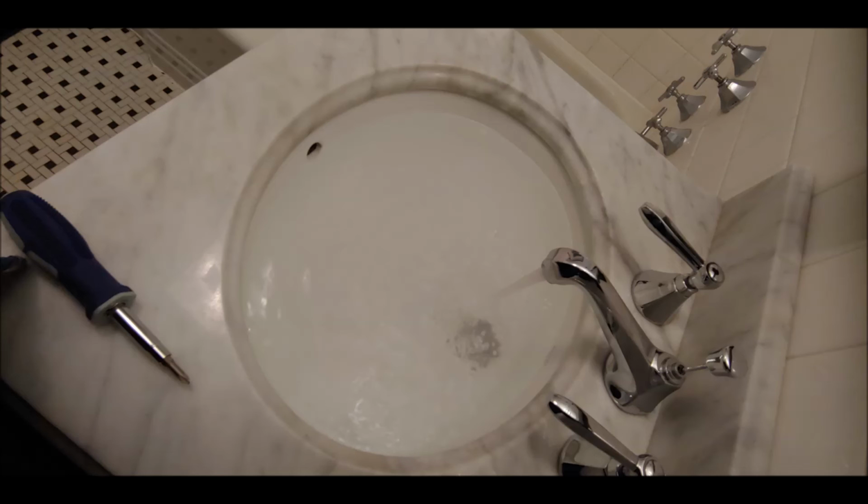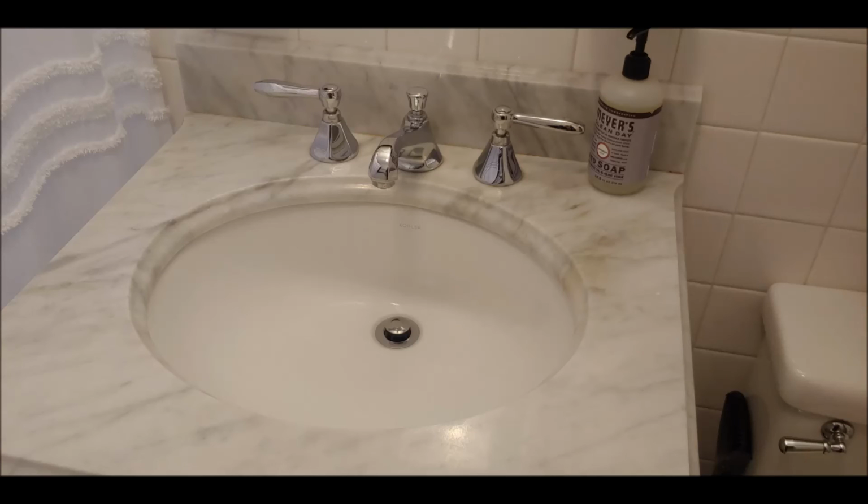That allows you to use the sink versus having everything perfect, driving to the store back and forth, and not having the drain and the sink to use. So that was a good stopgap, and you do want to buy that ahead of time, because chances are your new undermount will not fit your original piping unless you want to do the piping at the bottom all the way through. So you might want to start early and give yourself an extra 2-3 hours of doing the piping properly and the S-trap and all of that properly, if you have the copper, or even if you have PVC.